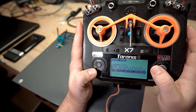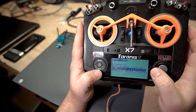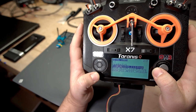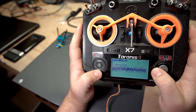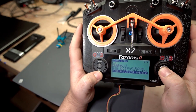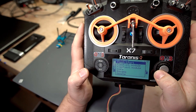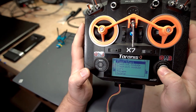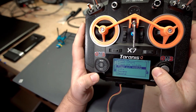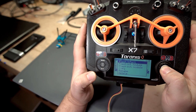There's an Access 2.1.0 and an ACCST 2.1.0 for FCC. I tried those originally, but the file you want is the version before 2.0 came out. You're going to click on this, hold, and it's going to give you an option. You don't want flash internal — that'll screw everything up in your radio. Just do Flash S-Port. If you're doing it from the back, you would do flash external module.